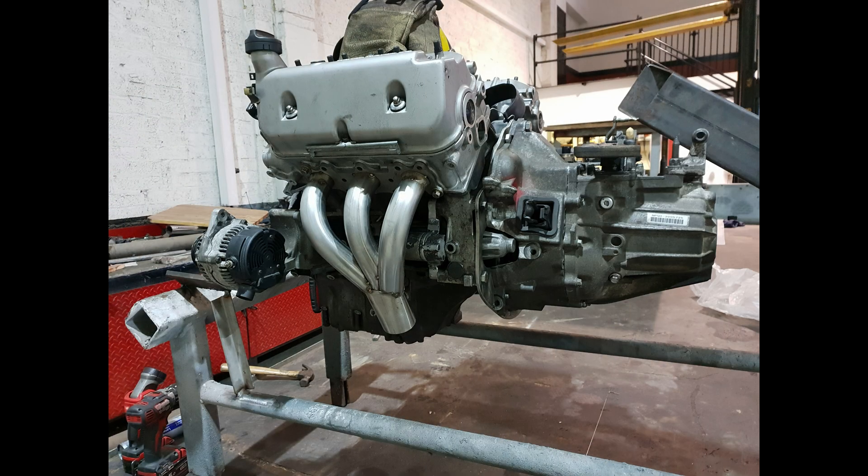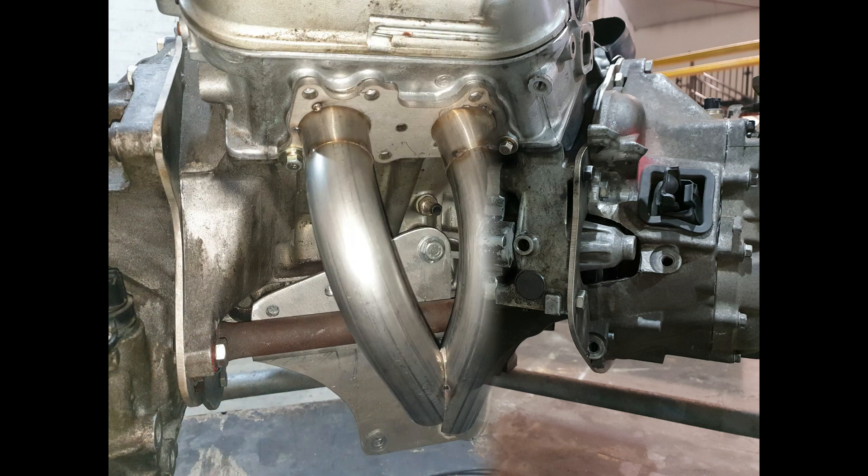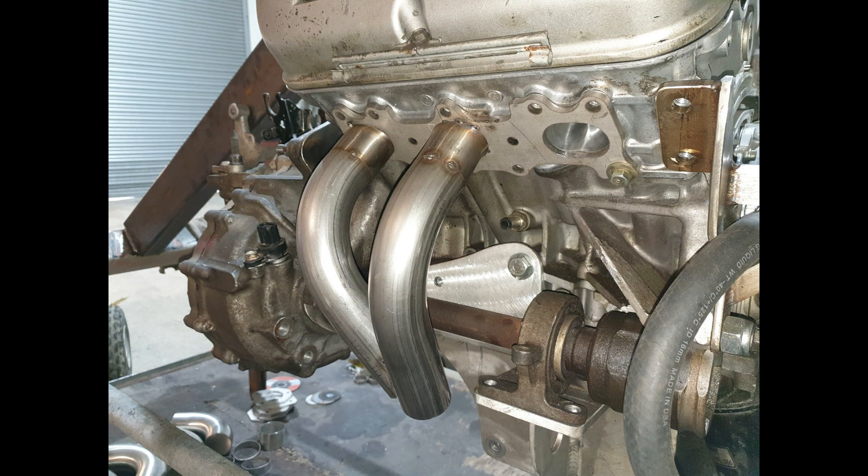The pipes had to be squeezed top and bottom to match the head and to merge three of them into the two-and-a-half-inch collector. Making sure there were no gaps - tight enough for a nice neat weld. This is the back side of the engine where the carrier shaft area had to be fabricated, as the engine is remounted in a different transverse position.